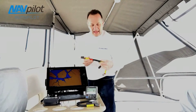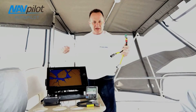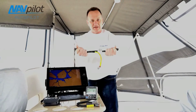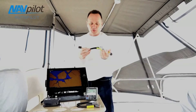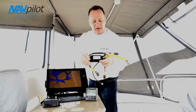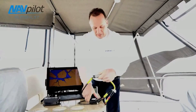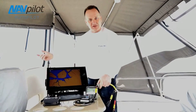So you'll actually go under the console, find that EVC computer, and you'll see a multi-link cable coming out of it. What we'll do is we'll disconnect the existing connectors that are there, and we're going to put this breakout cable in between those two connectors — so it's really pretty simple. Just two six-connector male-female sockets that we'll use to inject this cable right into the system. Be careful that you don't use this gray cable, because this gray cable goes out to what's called the Autopilot Gateway. So the Autopilot Gateway is part of the system, and what we'll do is break out this cable and connect this breakout cable into the Volvo Penta gateway computer right here. And that's basically all the system has in terms of how we interface to the actual Volvo Penta system.